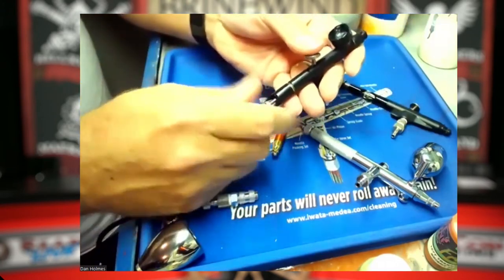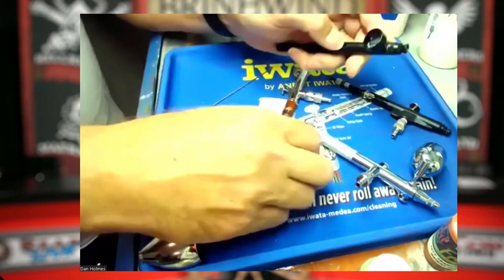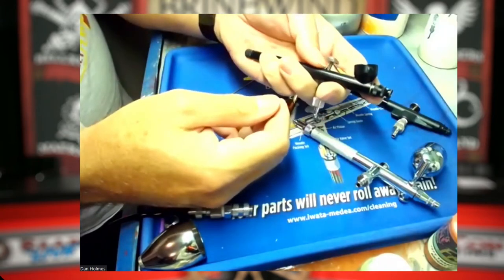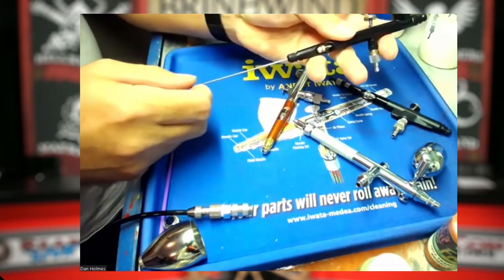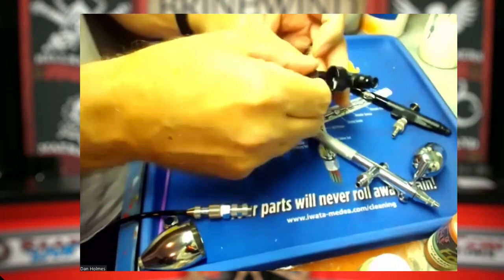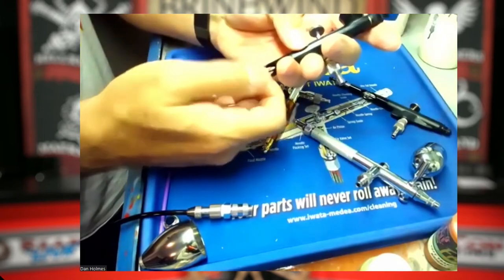There's this little piece right here — you hold it with your thumb and move it back a bit, but the trigger likes to pop out. There's no positive connection into the air valve to hold the trigger, so you've got to make sure it's seated in there before you reassemble. You can hold the spring back with your thumbnail to get it back in. Tighten down the chuck and away you go. It does come with two different size needles but only one size of nozzle.